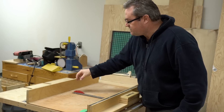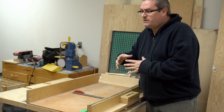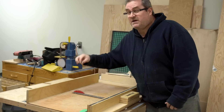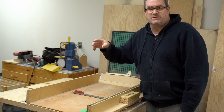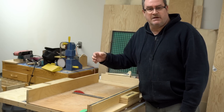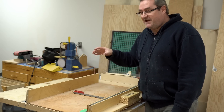The blade I'm using in the saw is a seven and a quarter inch thin kerf saw blade — the one you would normally use in a handheld circular saw. I'm using it here because it is a thin kerf. Having one of these blades to use with the jig is a good idea anyway because it will cut that one-sixteenth of an inch box joint that you may or may not use, but it's handy to have.